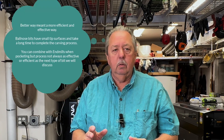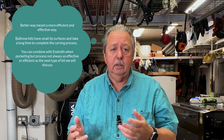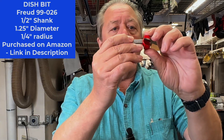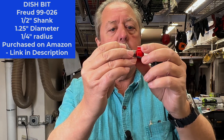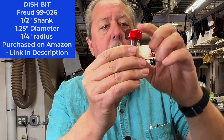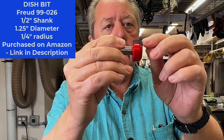After my first couple dishes, I decided I needed a better way, and I researched and found there are things called dish bits or bowl bits. They seem to be interchangeable. The advantage of a bowl bit or dish bit is it's typically bigger than your normal ball-nose, and it's got a flat end. This early bowl bit is a Freud bit. You can see it's got a flat bottom for doing the bottom of the dish, yet it's got a radiused corner right here.